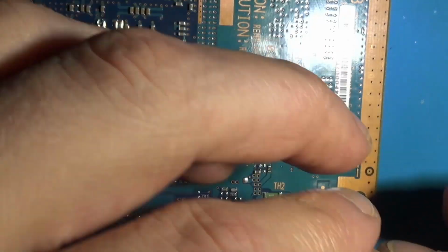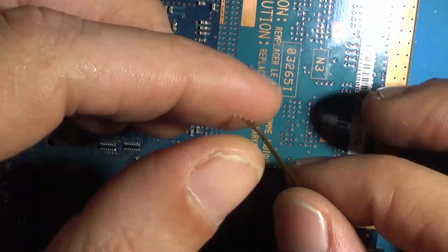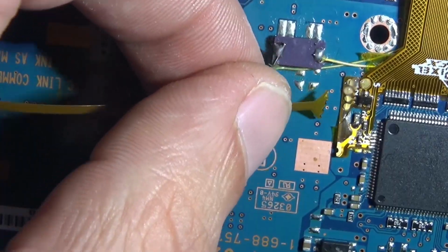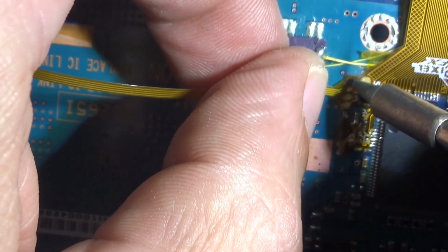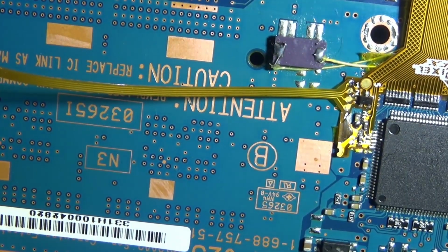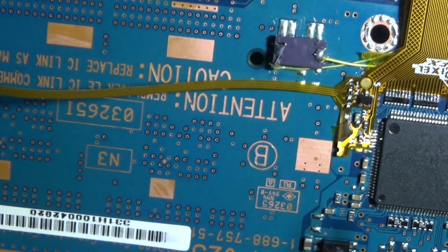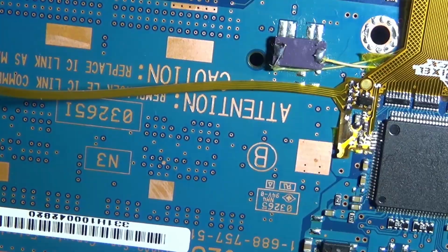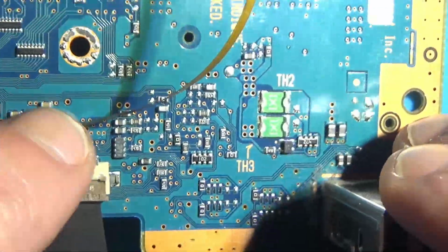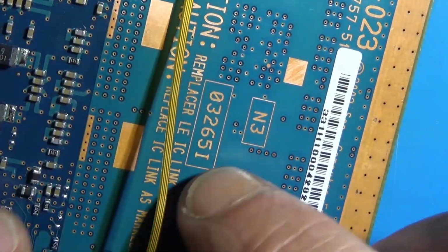So yeah, you do that quick right angle, loop it around, and you want to make sure the traces are going up on both times when you're soldering it to the connector. These traces, you want them to look gold instead of blackish. If they're blackish, it's upside down. And there we go. I think I may have tacked it down with some UV resin, some tape, whatever. Something to hold it to the board. It's not a bad idea.